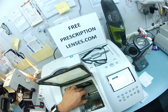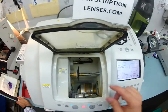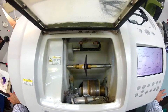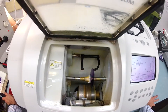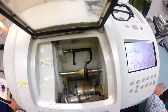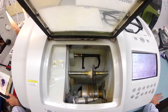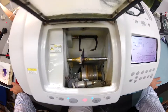Put it in the edger and hit start. The tracing element is going to come down and trace the shape of your right lens. It's going to trace the concave side of the lens first, which is closest to your eyelashes, then scoot over and trace the convex side, which sits away from the face. All the while, the calipers measure the thickness of the lens to know exactly where to put the bevel into the frame.